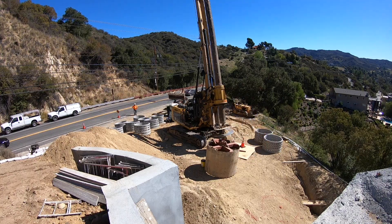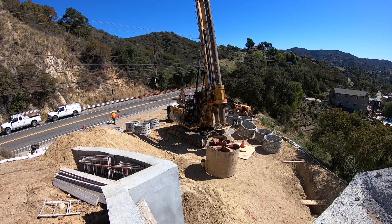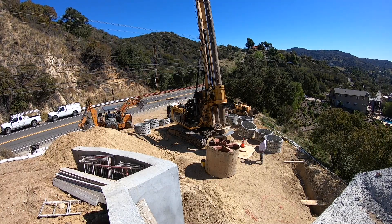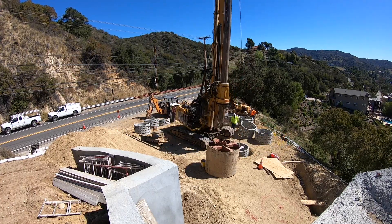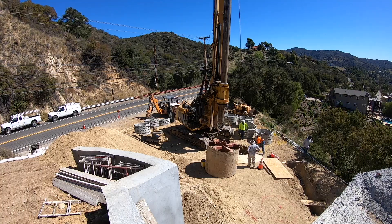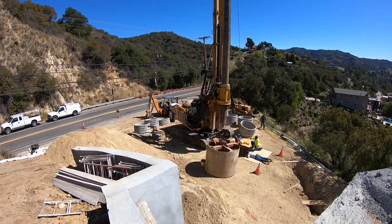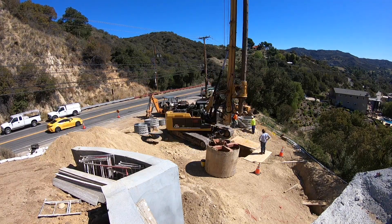They're going to pick these up and stack them down in the pit. We have 35 feet worth of liners in a 50-foot deep hole. They'll put a cap on it, backfill the outsides with gravel — about 6 inches of gravel all the way around the liners — then top and cap that off with 15 feet of earth.